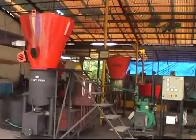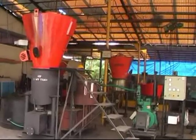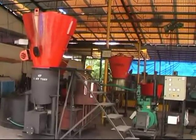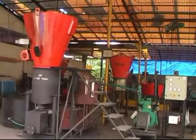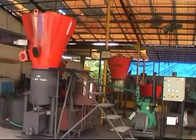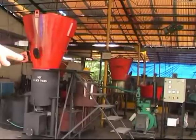This is a GAS-11 power plant. I wanted to show a smaller power plant before we go on to the larger one, so that we get a good idea of the actual components that go into making a power plant. The orange and black equipment is the gasifier itself, wherein the biomass gets loaded from the top and the gas comes out from the side. The one in brown is a filter, and the one in green is the engine gen set.